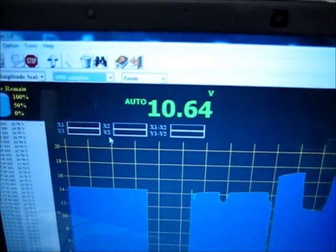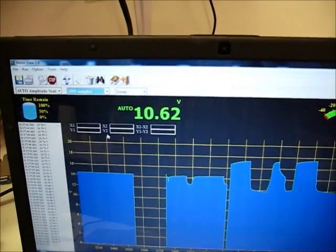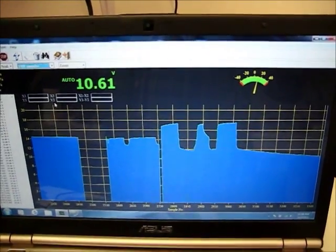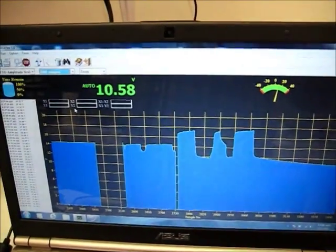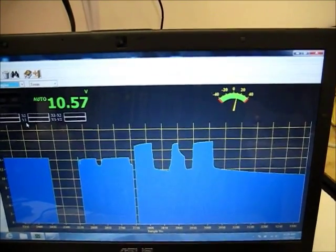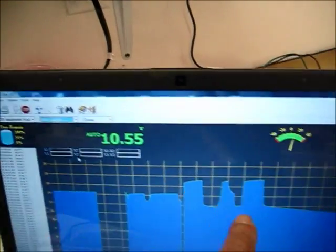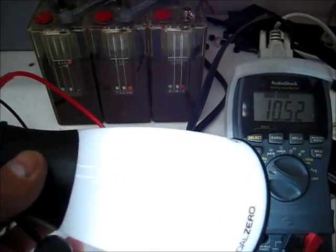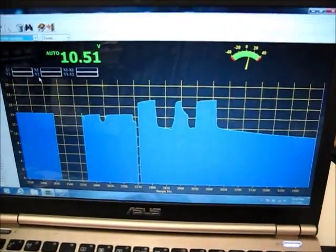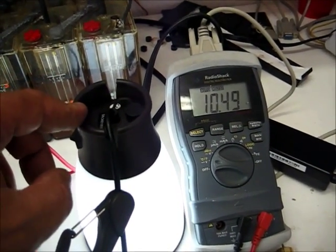You can see here that this is starting to slow down a little bit, so it's going to find a plateau. The nice thing about this type of situation is that you have a lot of extra energy. A 12 volt lead acid battery might sit at 12.67, but at 12 volts it's dead — you've used all that. This is quite different. I'm at about 1.7 volts now and I've got to go down to 1.2.